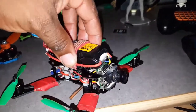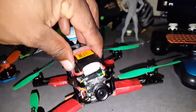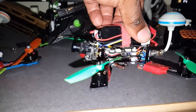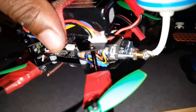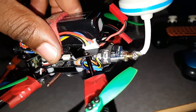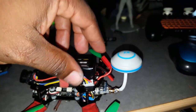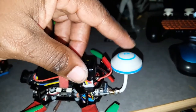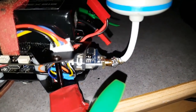Like I said, I added a true FPV camera to it. I got a slight angle on it. It's not much of an angle, but it's a slight angle. All right, I got the Boscam 32 channel transmitter on it, which I had laying around. I had a broken pin antenna, the pin broke out the middle of it, that I soldered to the Boscam.